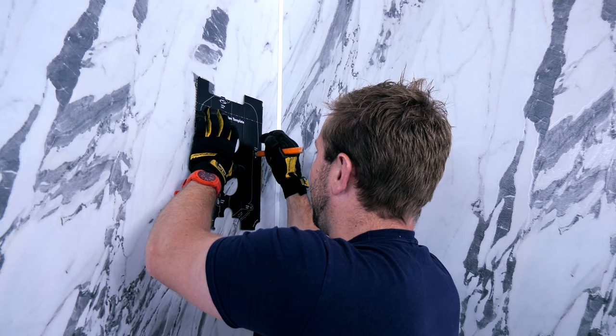There is another way you can do this and mark these up. You can get your actual water through — this is for when you've actually got a supply in already. Then you can just pop this on here, use a pencil to mark your holes, and then drill your holes. When it comes to the fixings, use the fixings that are supplied, but I like to use the ones that I'm always used to — it's just a plumber thing.